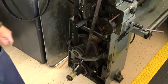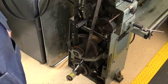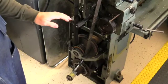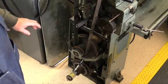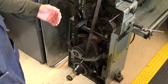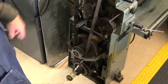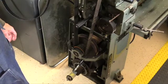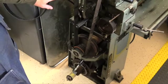Good morning, welcome to Northwest Airguns. I'm John and today we've got a project with our Claussing Lathe. I picked this up a while ago and I really like it — it's solid, it does accurate work, but it has a little bit of vibration in it. The variable speed also has been a problem in that I get down to about 500 on the dial and it drops to the lowest setting. So we've got two things going on: one is the vibration, and two is the variable speed drive.